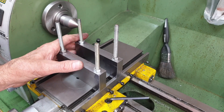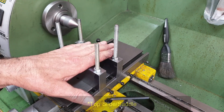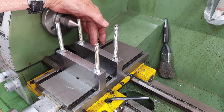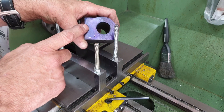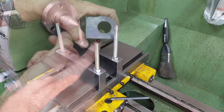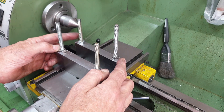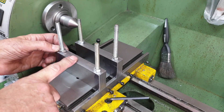To bore the cylinder I'm going to be using a between-centres boring bar, which means that the cylinder block will somehow need to be attached to the saddle but positioned so that the centre line of the cylinder is on the centre line of the spindle. I've measured the distance between the spindle and the top of the saddle and that's 75.5mm. On the cylinder block I've got a distance of 27mm between the centre line of the cylinder and the reference face — the steam chest face. That means I need to offset the cylinder block by 48.5mm, and to that effect I've used some 19mm plate and machined these two pieces, both parallel at 48.5mm.